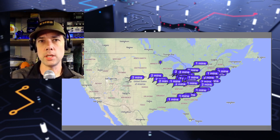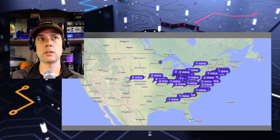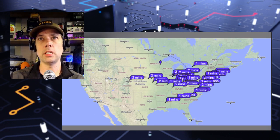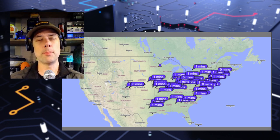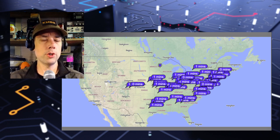Let's look at transmit on the vertical. Switching back and forth between the inverted V and vertical patterns — you can kind of see that the vertical is a little fuller in the areas where it's transmitting, but the pattern looks fairly close to being the same. And again, this would have been four to five hours later in the day, so it could just be atmospheric conditions more than anything else.